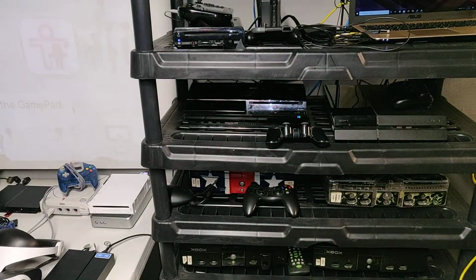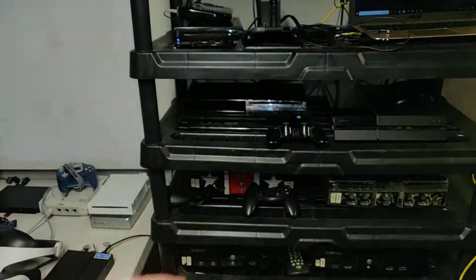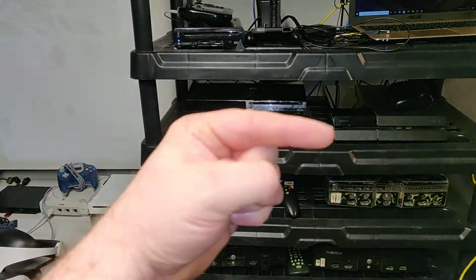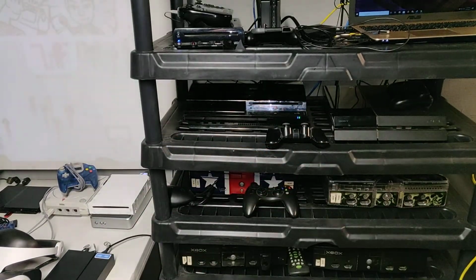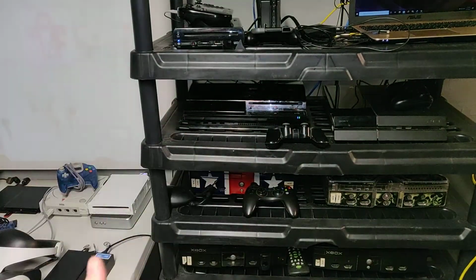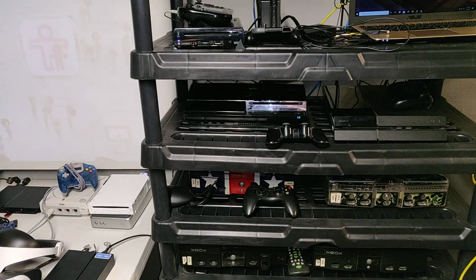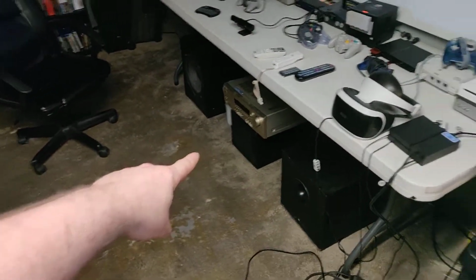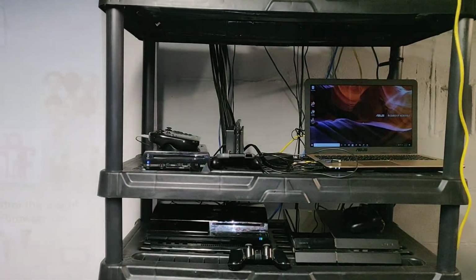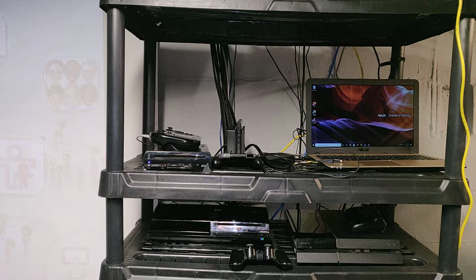Okay? So now we've gone from the KVM switch to the HDMI splitter, and then the next device is something called a Toslink audio extractor. And what you do is, again, it's a little box, and it has HDMI in, HDMI coming out, but it also has an output port for Toslink, fiber optic audio. And then I take that fiber optic cable and I run it down to my receiver down here. Now the HDMI cable is ready to pass on over to the projector via HDMI with its audio being removed.